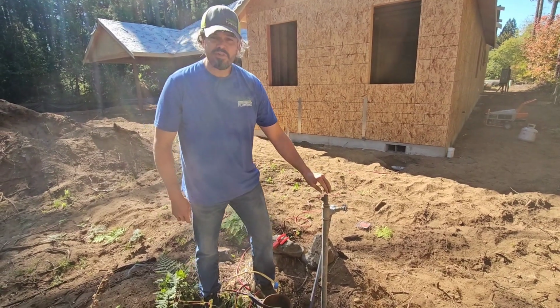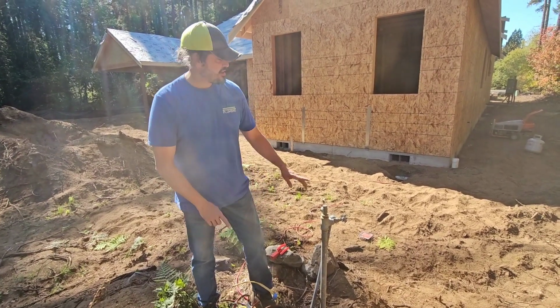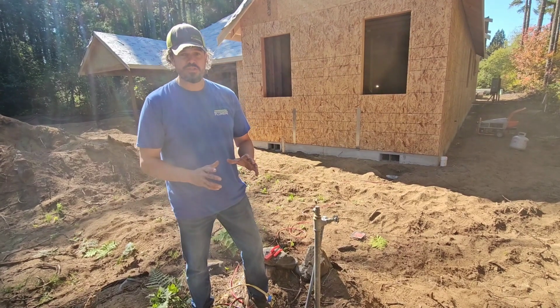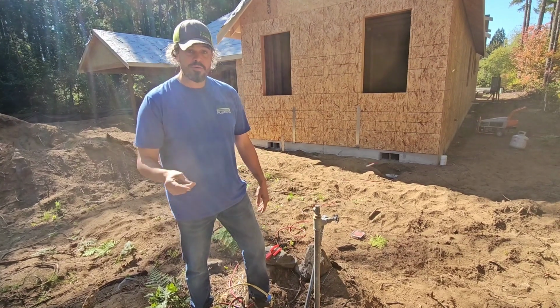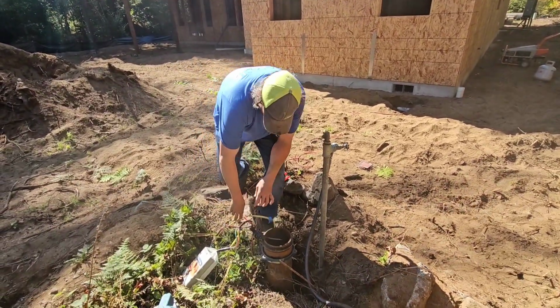The reason why they're putting the relief valve here is there's going to be nothing that turns off the pump. After we temporary wire this off of our generator, it's going to be generator on or generator off. There's no pressure switch or pressure tank that the pump is pumping up to, and there's no pressure switch turning that pump off. So it's going to be generator on, generator off, pump off. So this is what they did, which is really smart.